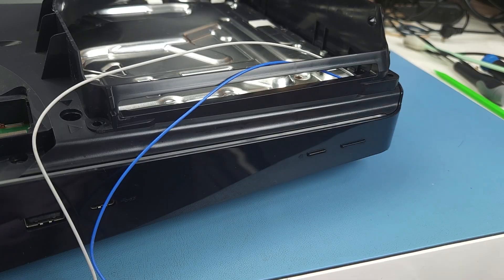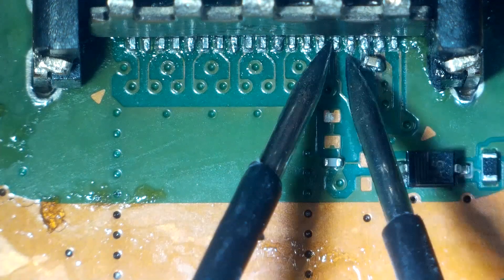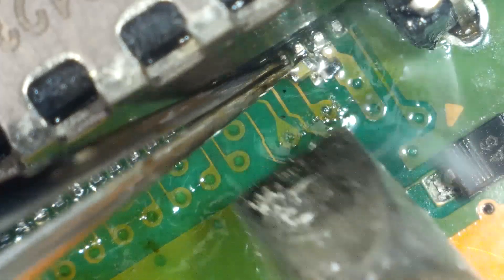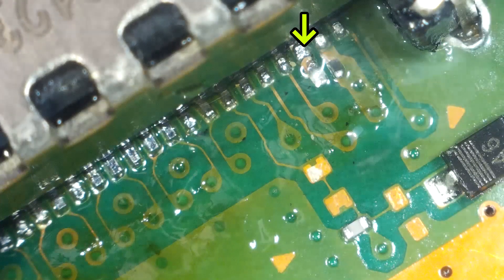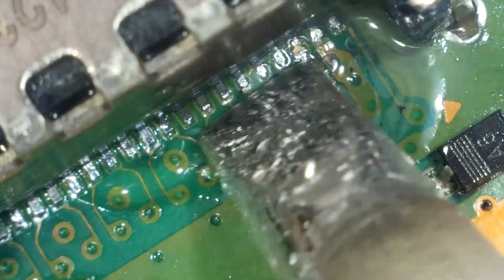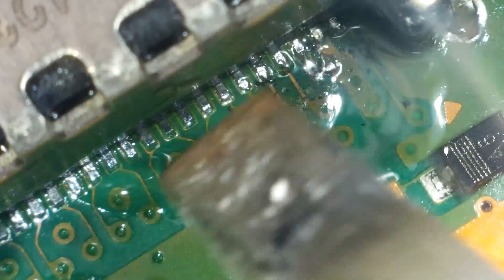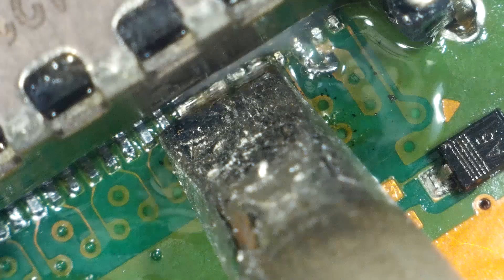Let's try it. No good. I checked all the pins again and nothing was shorted or loose. It's possible that the HDMI encoder has gone bad, but I wanted to resolder everything first — but while doing so, the capacitor broke. I was thinking maybe it already had a crack in it, and that's why my first repair attempt didn't work. I've heard people say it isn't necessary, but others claim it doesn't work without it.